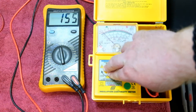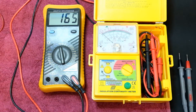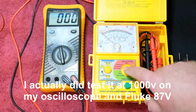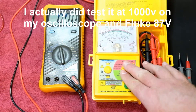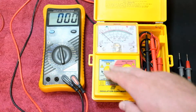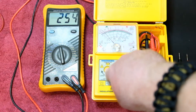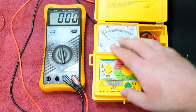If you want to do continuous testing you either have to hold the button or you can turn and lock it in place and continue to test the circuit. This meter says it can do DC 1000 volts but I'm a little concerned about knocking 1000 volts out on the meter I'm measuring with, so I'm not going to go that high. I'm quite happy with what I'm finding on the output so far. That's pretty much how the insulation resistance part of this meter works.